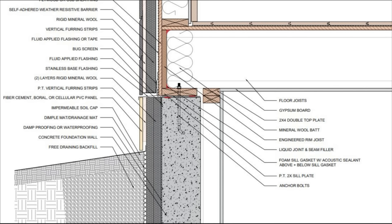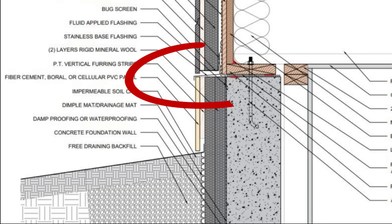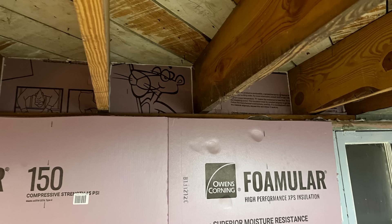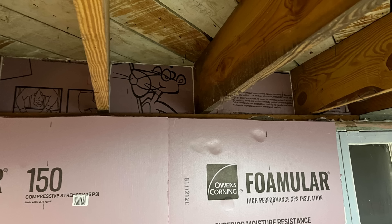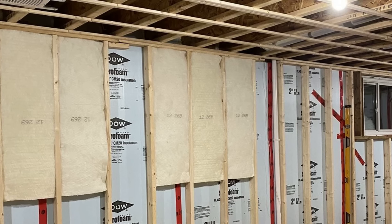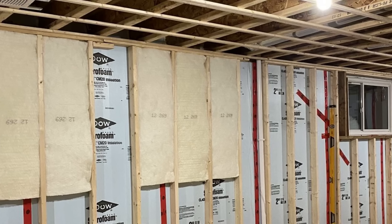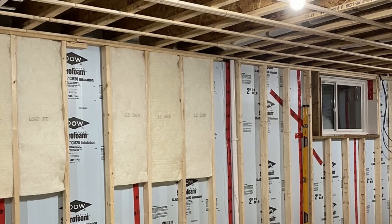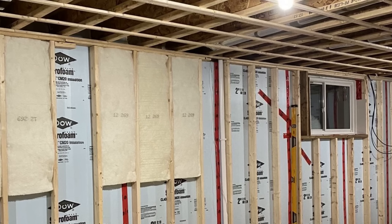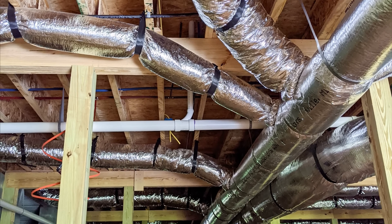You also have to consider the termination of the top of the rigid insulation in your design. You don't want rigid insulation sticking out of the foundation if you don't also have rigid insulation on the exterior walls, as it can look a bit odd aesthetically. Insulation on the interior side of the stem wall is not incorrect if you detail it properly — use rigid foam on the interior side with taped joints and good air sealing, and you won't have any issues. It works for basements and crawl spaces. There's a small thermal penalty, but it still provides a thermal break between the interior conditioned space and the exterior environment.